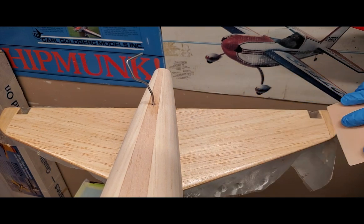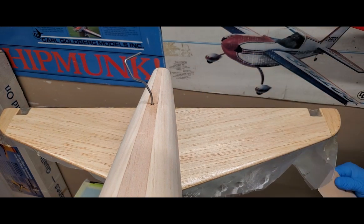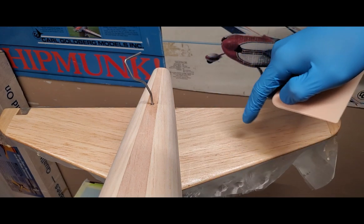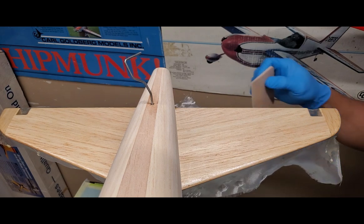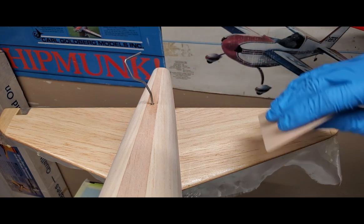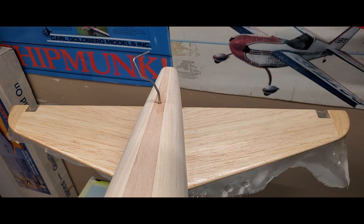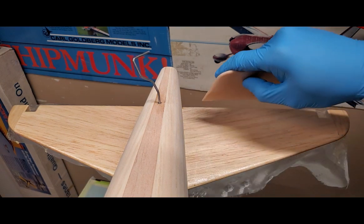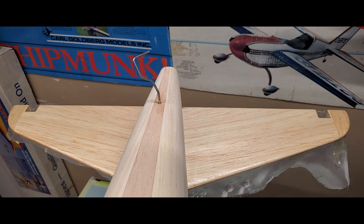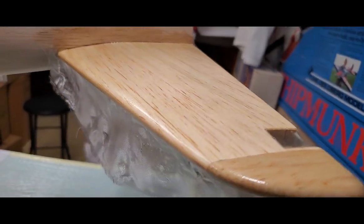That's your main thing too, is just getting the resin here even all the way around, so you don't have these globs of resin. All right, because the more globs of resin you have on your surface, that's just more sanding that you've got to do. At this point right now, you've got full control of preparing yourself for success, right? So you don't want to do a lot of unnecessary sanding that you don't have to, all right? So with this, let me go ahead and bring you in closer, and you'll see with this right here, it's going to be very minimal sanding, guys.